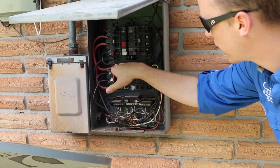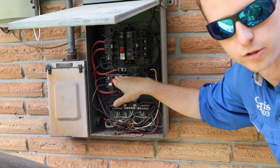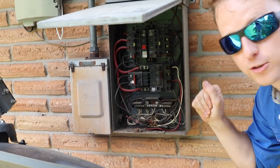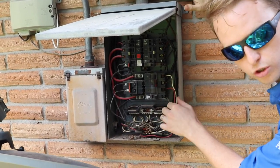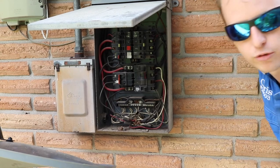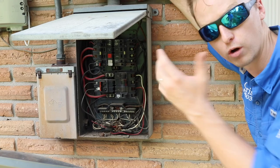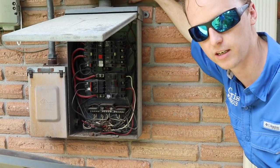Also, this main feed is actually triple tapped, and the other main feed is triple tapped too as well. You also have improperly covered wires, so you don't have the proper colored wires. The box isn't bonded and there is no ground to the box either. There are several other issues, but the main thing is we know enough that we need to call an electrician and let them know that this panel box is defective.